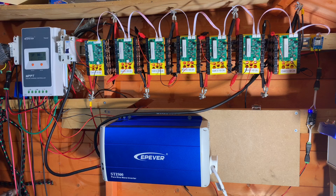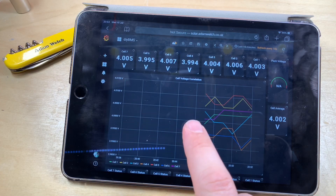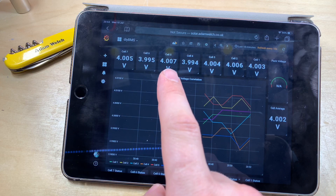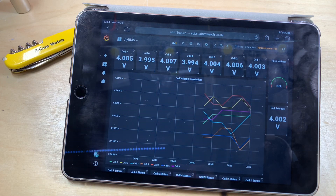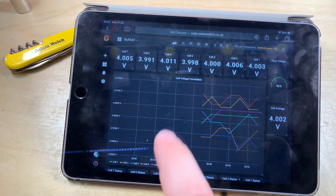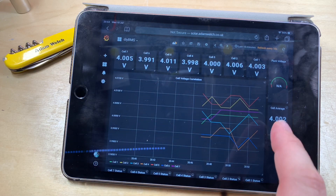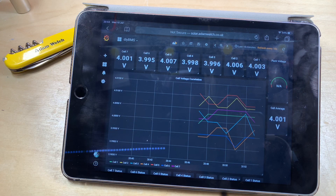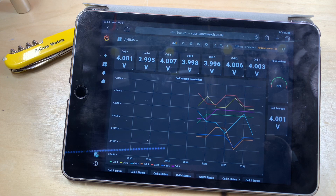The DIY BMS has been running for a few minutes and is reporting all the pack voltages. Cell 5 is now just by the slimmest of margins the highest. Over the next couple of days as it charges and the BMS balances the cells, it should come back to the cell average of just over 4 volts. Now that it's acting as a 20P pack rather than a 16P pack, hopefully I won't see the same level of sag or overcharge seen earlier. Thanks for watching!